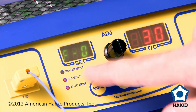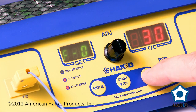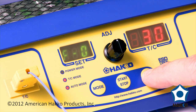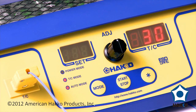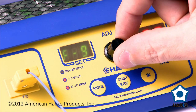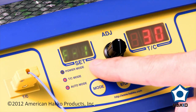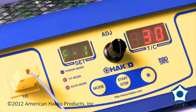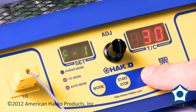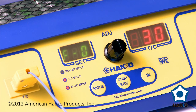If I wanted a different profile, I would hold star down to get F0 showing. At that point I can use the knob to choose any of the ten profiles, 0 through 9. I choose the one I want, press star, and then run through the programming process again to set up a different profile, say for a different board. In this case I've set up F0, I'm going to choose F0 as my profile, go ahead and hit start, and we're going to see how this works.